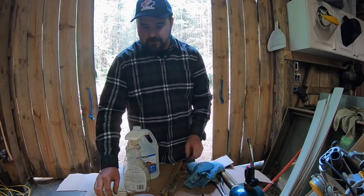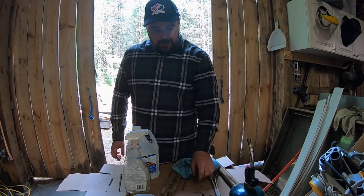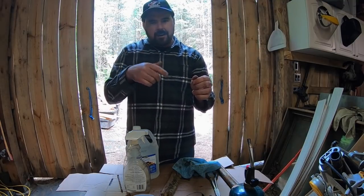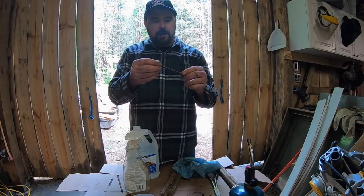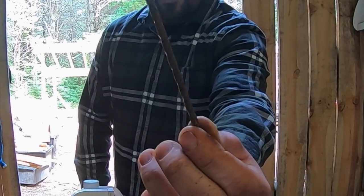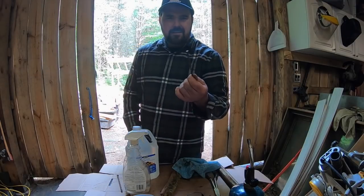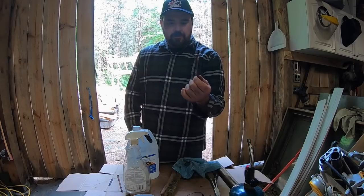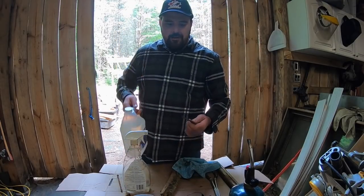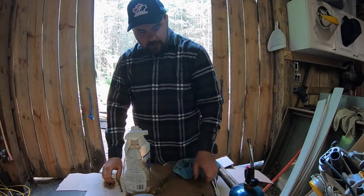So that's more or less my trick with rust. I'm going to throw in some bits and pieces that are rusty, and then with a little bit of movie magic you'll see the results after a few days of soaking. Here's a bit of surface rust on some nails — yes you could wire wheel it, but if you have a box of nails isn't it easier just to throw them into a container with about a dollar's worth of vinegar? I would say so. Throwing the nails in now.